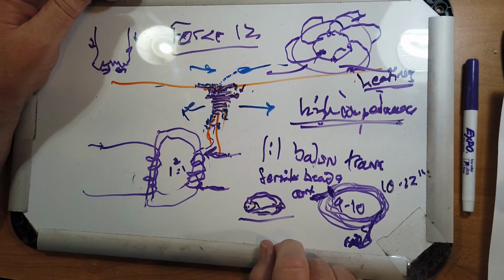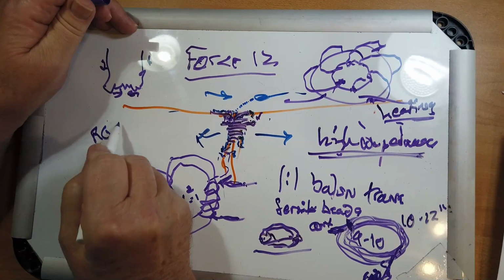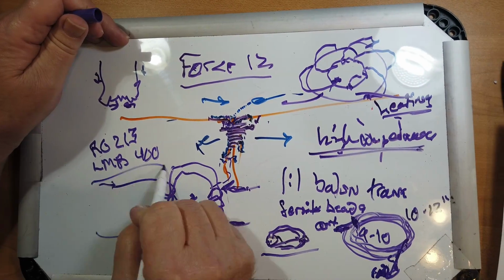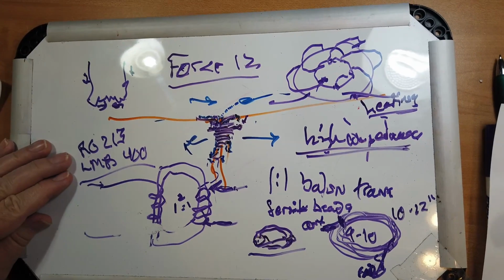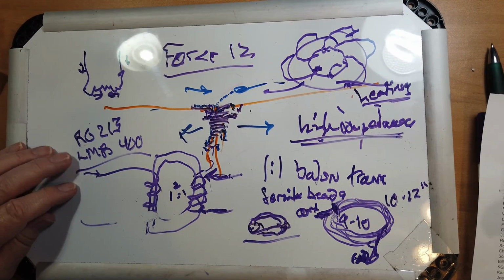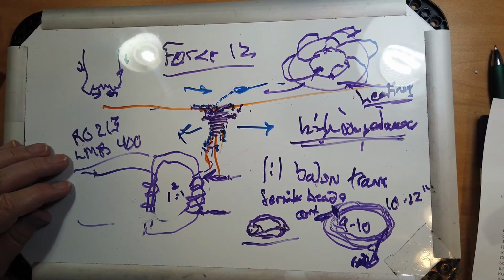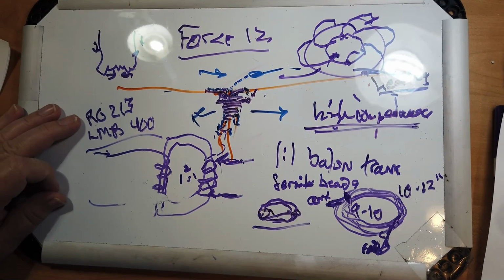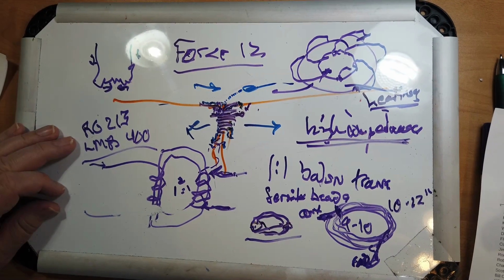If you want to get up into the 1.5 kilowatts, I suggest going for either RG213 or LMR400. The 400 is harder to deal with normal tools, but with the proper tools that you can get from Times Microwave, they've got a very, very nice and easy to mount connector for these. It's actually quite innovative, I think. It's all crimp connector. These you can do your standard where you crimp the exterior and solder the interior. And make sure whatever you do up here, it's well waterproofed.